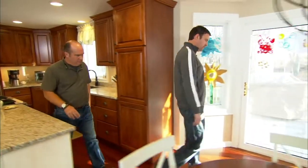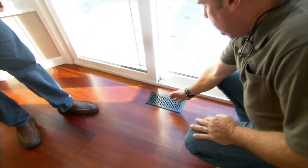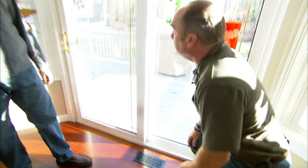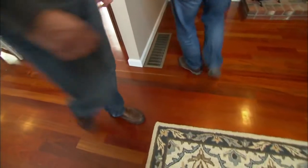We wrote to you guys about our heating and cooling system. It's a forced air system. I can see a supply register right here. That's going to blow warm air in the winter right against the glass. You should have a return here somewhere. We have a return right around the corner. So the air goes back to the furnace to be reheated right there.